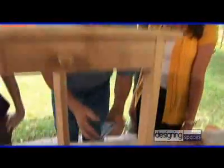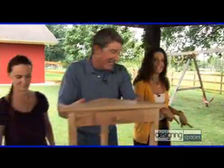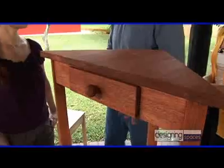What I like about applying stain this way is that you get to determine the final color by how quickly you wipe off the excess stain. If you want a lighter version of the gun stock, take your rag within just a few seconds and wipe off all the stain. If you want it a little bit darker, put some more stain on and let it sit longer — up to about 10 minutes is the most before you need to wipe it all off. I like to let the stain sit overnight — six to eight hours — and then it'll be ready for a finish coat. Here's one that's already dried with the gun stock stain applied over the whole thing; as you can see, the wood took it very evenly. Now we need to protect the wood and lock in the color, and we're going to do that with fast-drying polyurethane.